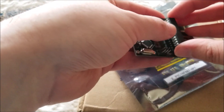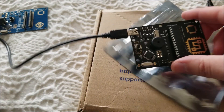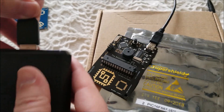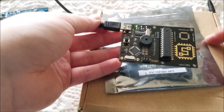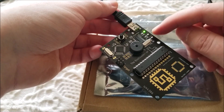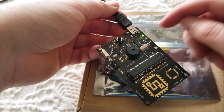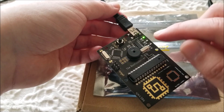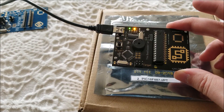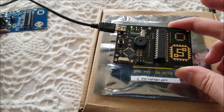I'm taking the chip and making sure to get it the right way around, plugging it back into the bootloader programmer board. As before, we weren't able to program this chip — it wasn't responding. Now I'll plug in USB. After I press the button, the middle LED should light up to show it's programming, then turn off and beep once, with the error light off if successful. There we go — it's done. I've recovered this chip.